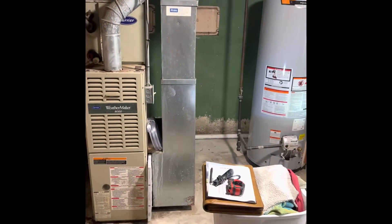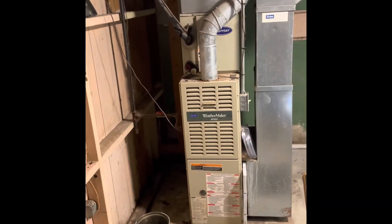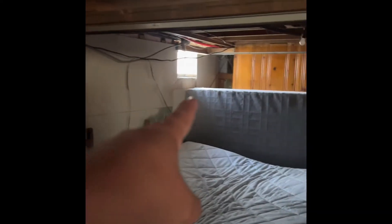Drain lines run through that piece of PVC pipe that's back behind the system. I just want to run a new piece of vinyl — we're going to go through the wall here, back behind that wall, and then push vinyl all the way over to a floor drain here. So I'll bring about 30 to 40 feet of it.